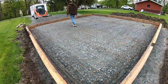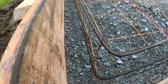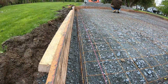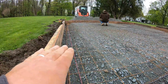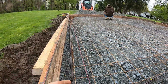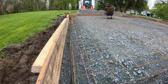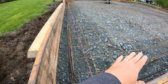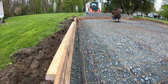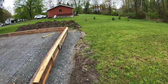And this is how we do the crab cage. What I was saying, 2 rebars, and I don't know if you could see that, but this wire mesh we bend at a 90 and then hook the bars to it, tie it, and it acts like a crab cage. It holds everything together. I mean, code just calls for 2 bars and then the wire up here not going down, but we give it some extra strength by doing that. It's just something I always do.